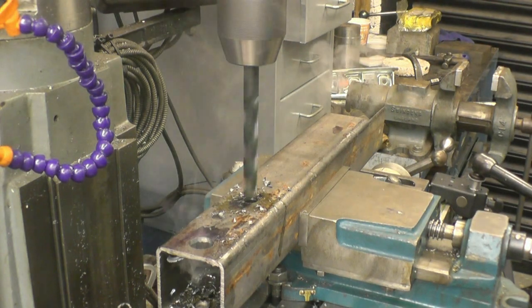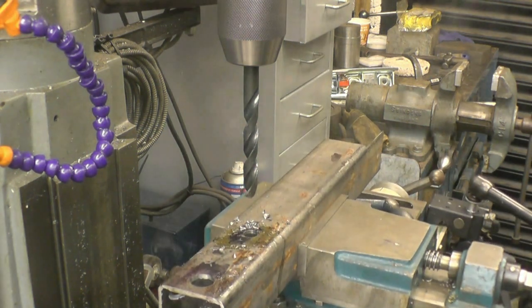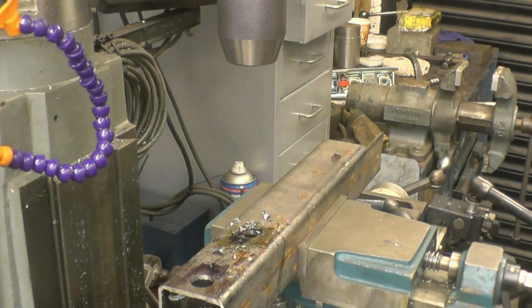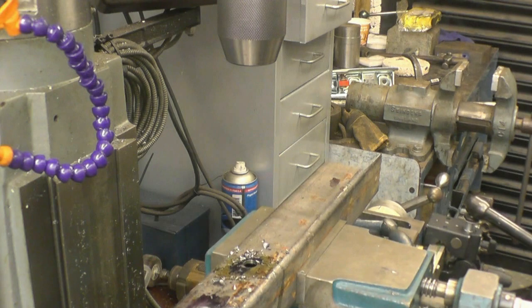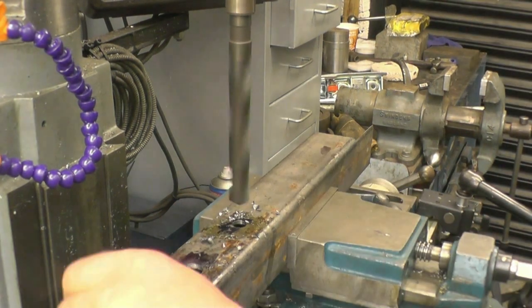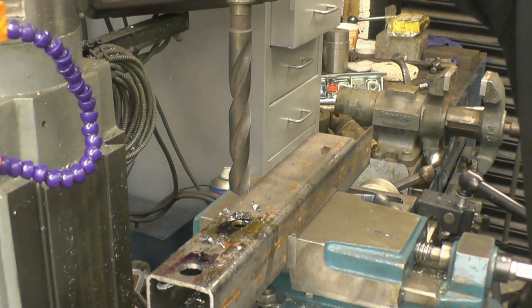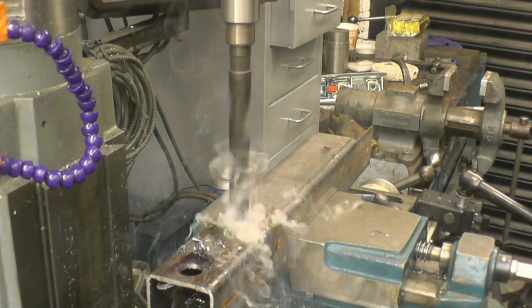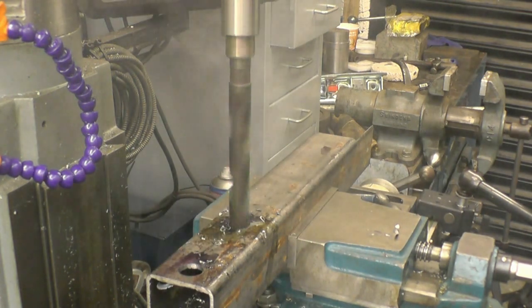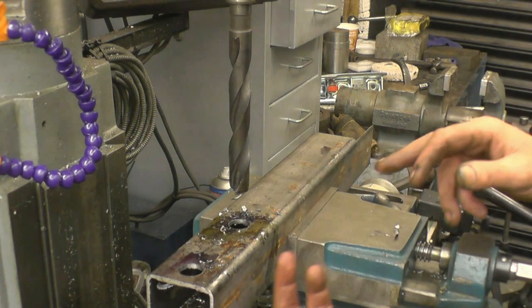Right, that's a good 12mm drill. I've already taken that one out to three-quarter - we'll do this one now. When I say three-quarter, I really mean 19mm. I've got a three-quarter inch drill in here now, just going to slow that down a little bit on the first side. Right, so we've now got a 19mm hole on each side and a 12mm hole on either side.